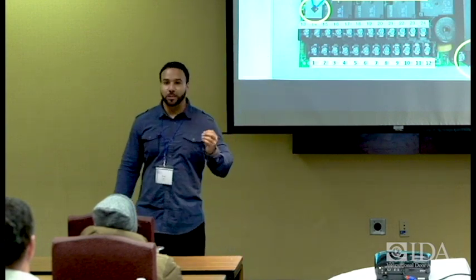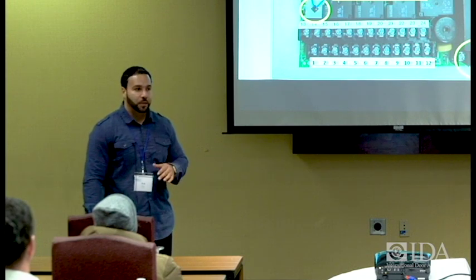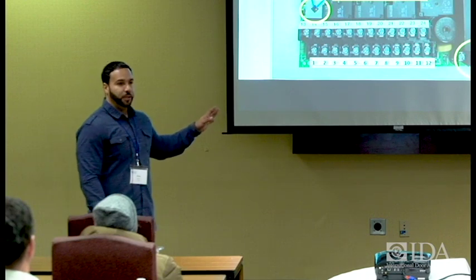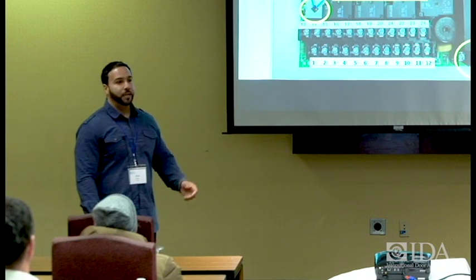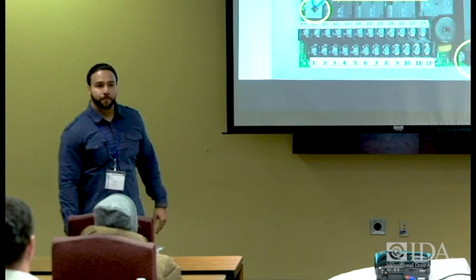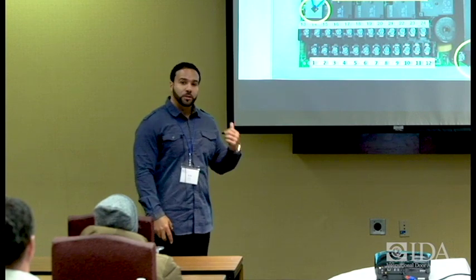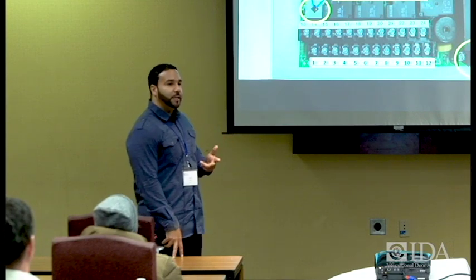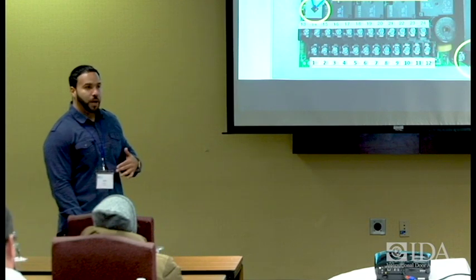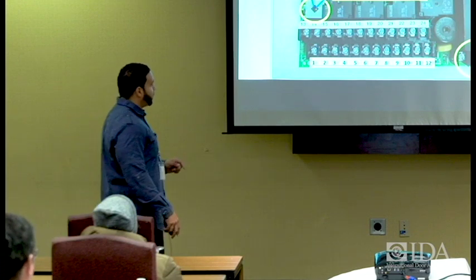So that must be a normally closed or normally open C-form dry contact from the building alarm system or smoke detector through a relay module. Then it comes to the unit, and when it's activated, it's just a changing of state. It's like a switch, closed, open. That's simple. If that system has power running through it, it would damage this operator. So you have to verify that they have a true, what we call regulated alarm system with C-form dry contact. And if they do, it ties into the alarm circuits on this operator and functions properly.